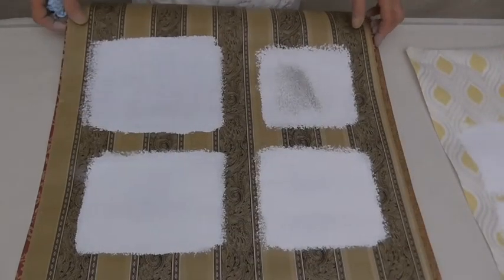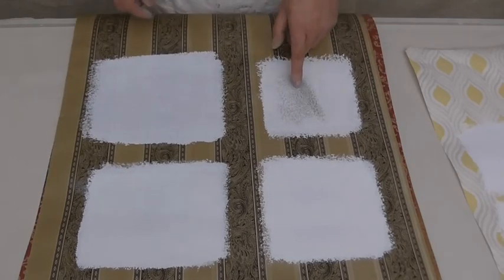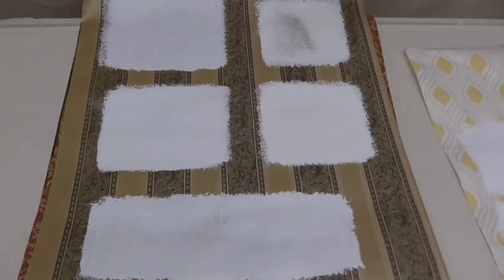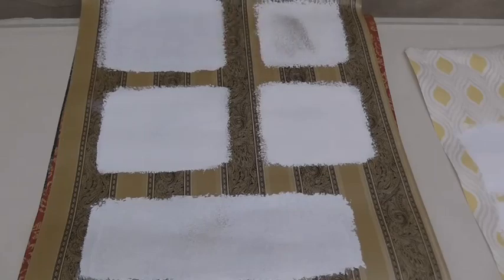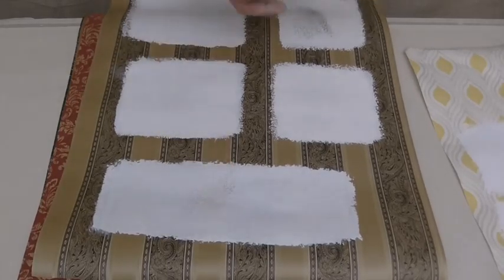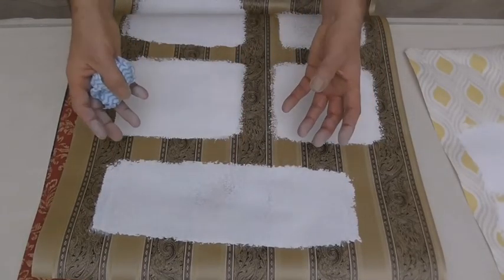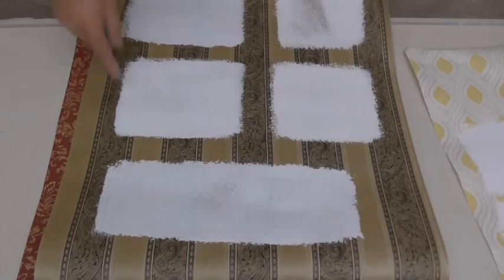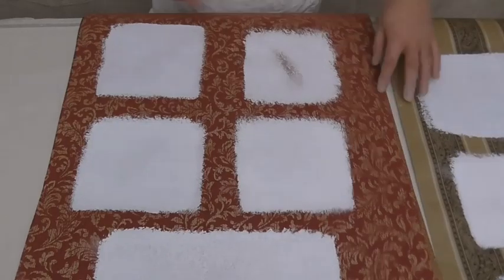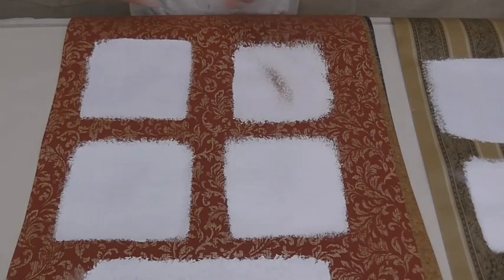And then throughout the papers, this is quite a shiny vinyl, slightly textured. You can see how it started to wear off. Bearing in mind these have only had 4 hours to dry, but overall not too bad. A little bit worn off there, but it's okay. It's only had 1 coat, not fully dry. Again, just Dulux silk, vinyl silk. And they've all done the same, relatively the same. The wipeable matte not performed very well.